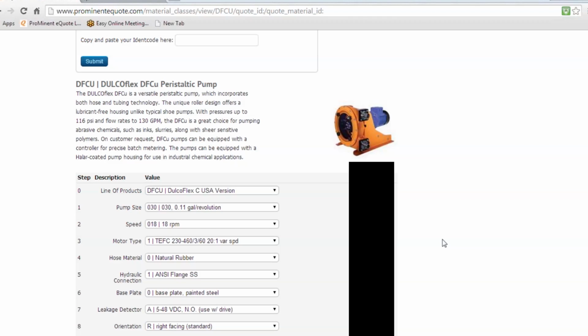As far as the rotor, no, the rotor is going to remain cast iron because cast iron is pretty rugged. Even if you get a little bit of sodium hypochlorite, yes, it may tinge, it may change a little bit of color, but it's not going to break it down completely. The other thing is that because we have early leak detection, and that leak detector is put at the bottom of the pump, that will not affect the rotor because it will not flood it. So the housing will not be flooded due to early leak detection. Very good question, Mark. Thank you for that.